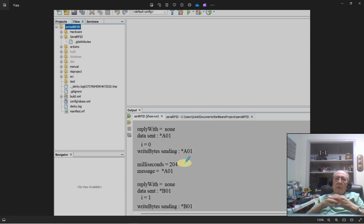And so now I can sit there and wait for the message to come back to my reader. And so my message comes back in and I test for it. And when that reader has nothing for me to do, all it does is simply echo back my command. So it echoed back A01, and that told me, oh, this reader had nothing for me to do. And I move on to the next reader, and I send out B01. Do you have anything for me to do?